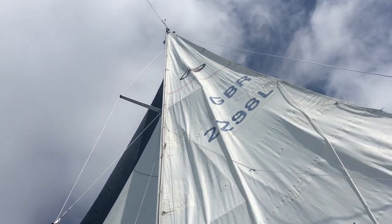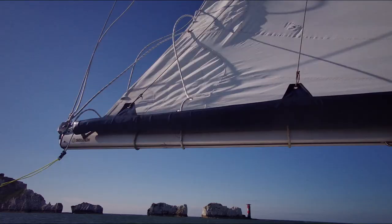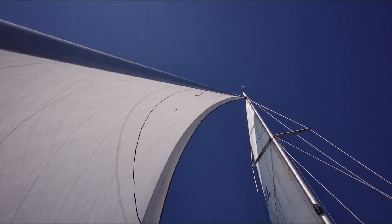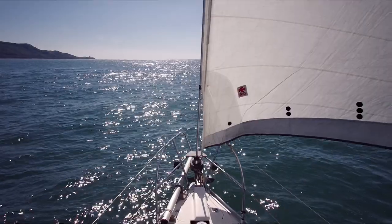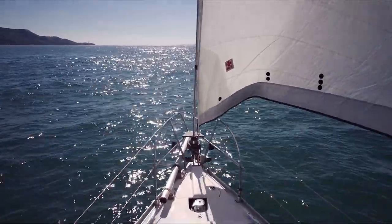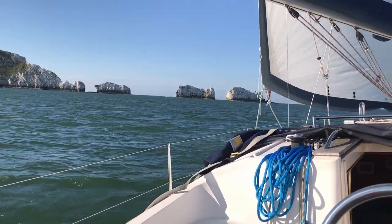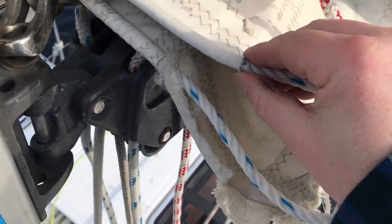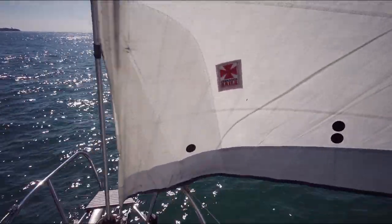Modern cruising sails are tough, but after years have been softened in the UV light from the sun, stretched in stiff breezes and chafed in several places, they eventually can't hold their shape. And that means they can't provide drive for your boat. Confidence is probably losing at least a knot and a half, maybe more in certain conditions, because her sails don't set properly. Add to that, the bolt rope is torn out of the tack, and the foresail's gone the same way, and our poor old rags are destined for recycling.